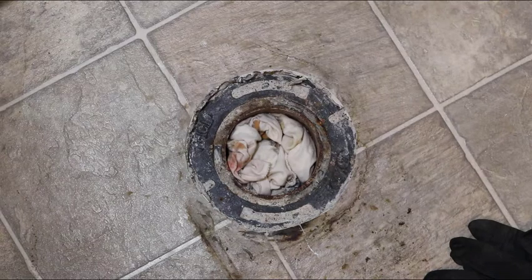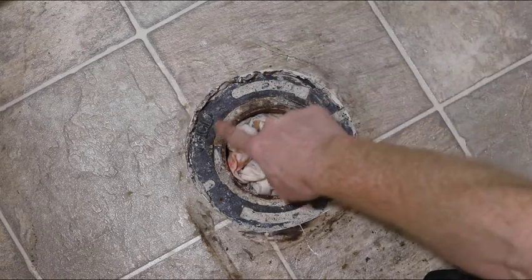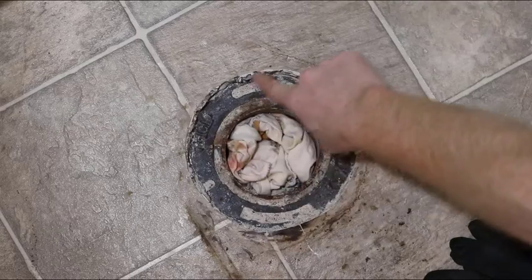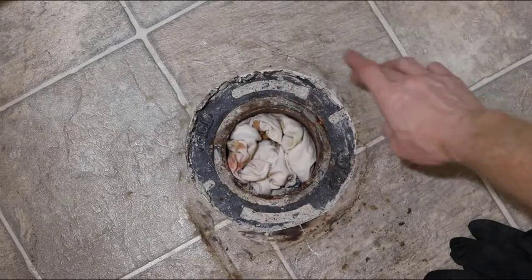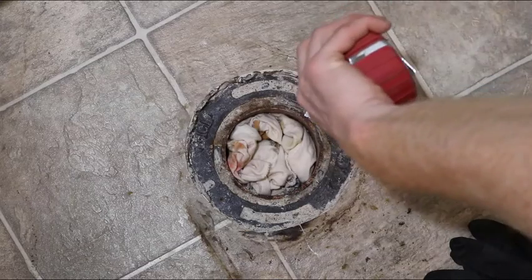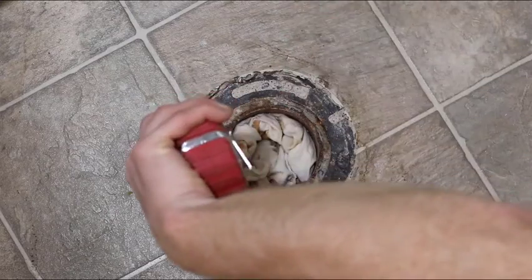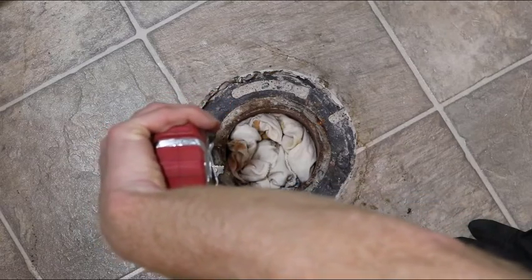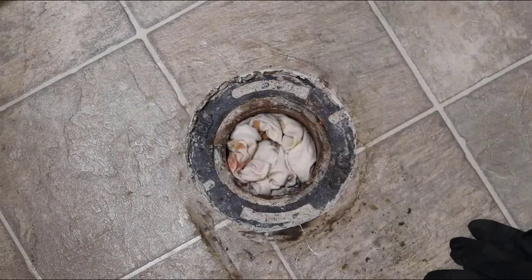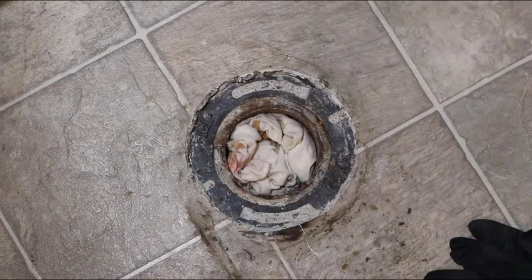And I have to admit, yes, I have worked on it just a little bit since you were last with me. What happened, for some reason, and I don't know why, is this is the old existing cast iron flange of the toilet, and it's pushing about 3/4 of an inch, almost an inch on one side below the floor level, and probably 1/2 to 5/8 of an inch below floor level on the other side. So the floor is a little cockeyed in one direction, it's not level.